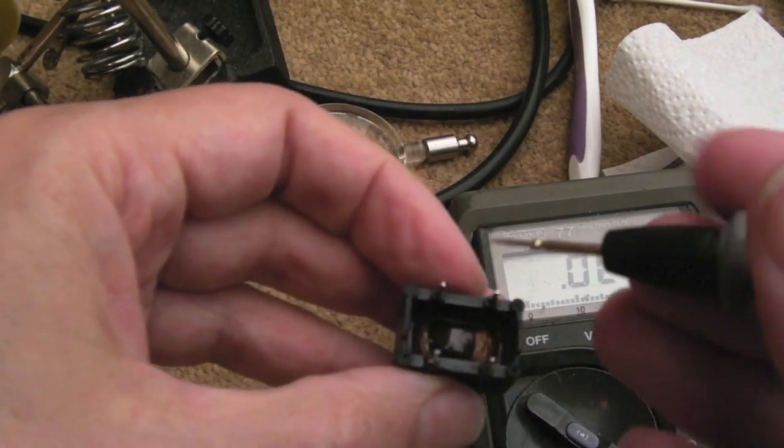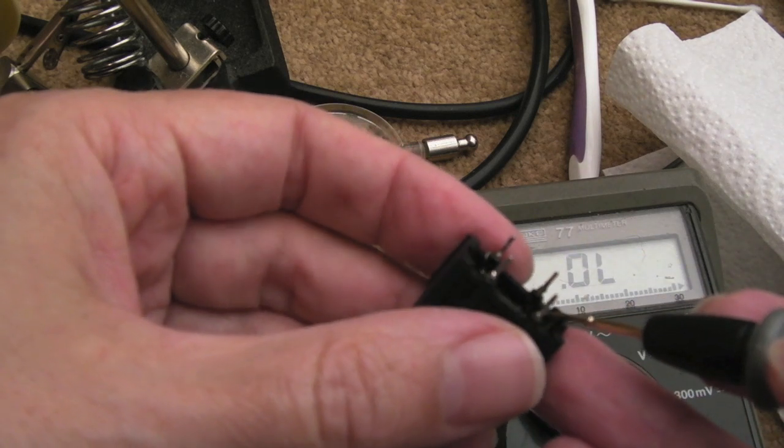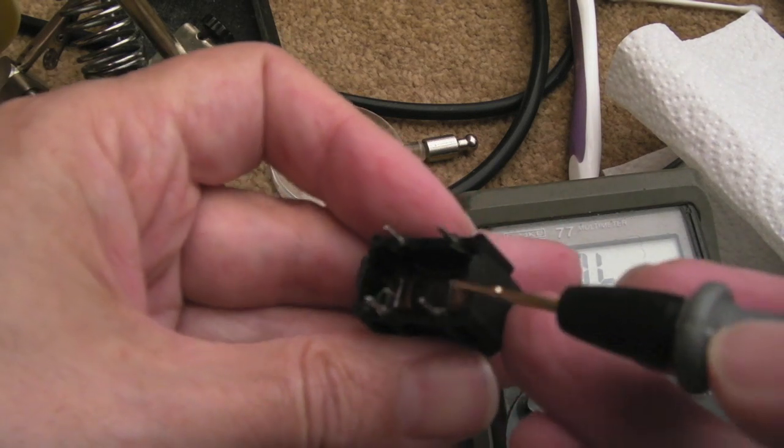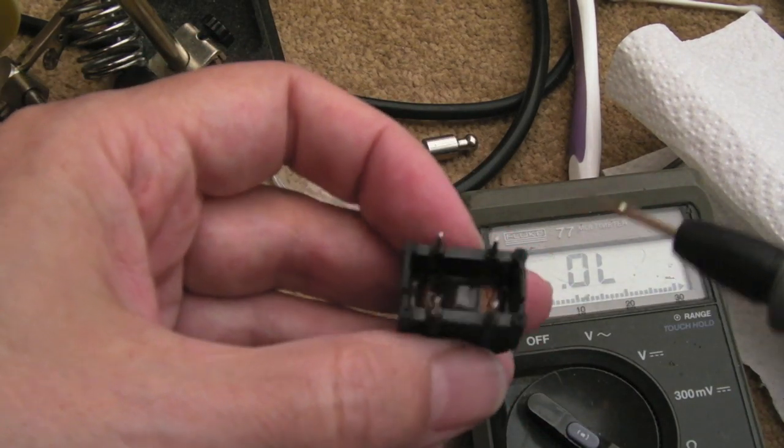It's just a question of that bond wire there, the transformer wire there. Is it about the same thickness as the wire that's already there? It kind of looks it. It might be a tiny bit smaller. The other thing is something could have caused this to pop. So you never know, it might just break again, but I think not.